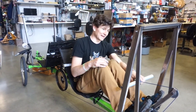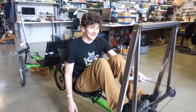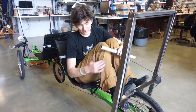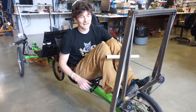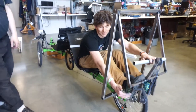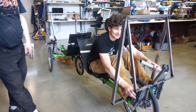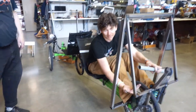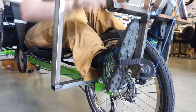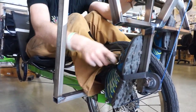But I think we have a great working plan, and I just have to build a better set of footrests here. I noticed that the angle of my feet changes as I'm rowing, to keep it roughly 90 degrees. But ideally, when I was at full extension, I really felt like I wanted almost another inch of space between my heel and the base. So I'm going to build a foot platform next, and angle that platform to make that difference, so that overall my foot angle is a little more horizontal and not quite so perpendicular to my shins. So those are the next little tweaks.